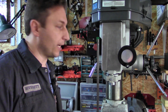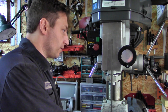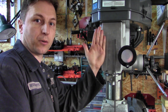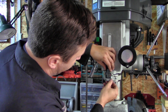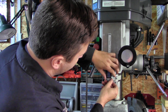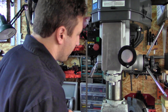To line up square to the table and to the spindle travel, I'm just using a height gauge — close enough. I went up against the front of the cover so I'm square going this way. What I've been thinking is drill a small quarter-inch hole here so the caliper sits about like so, then make a small sheet metal bracket attached here that comes down to grab the other jaw. The points on the back side will just be cut off.